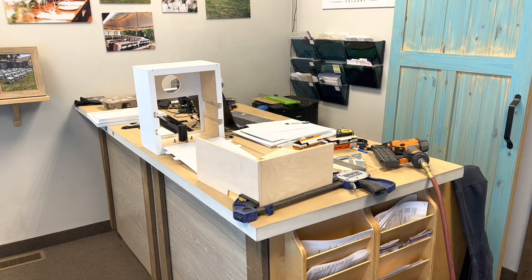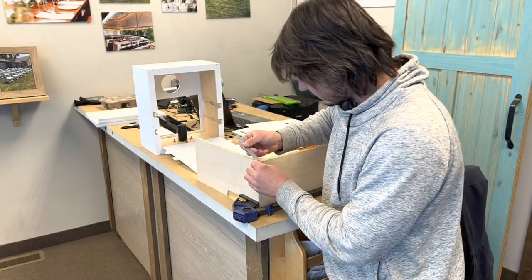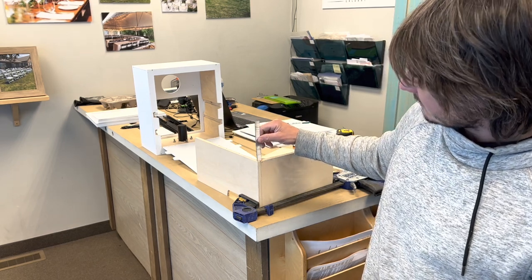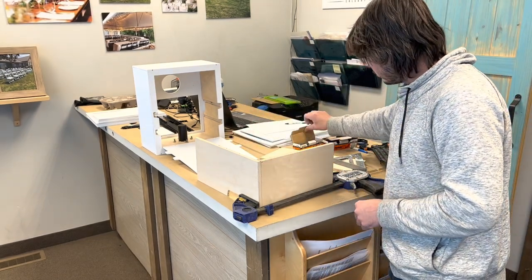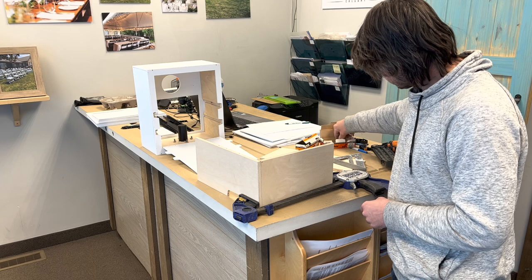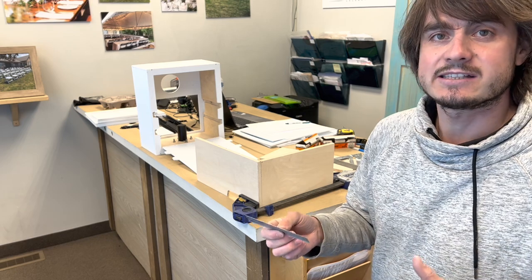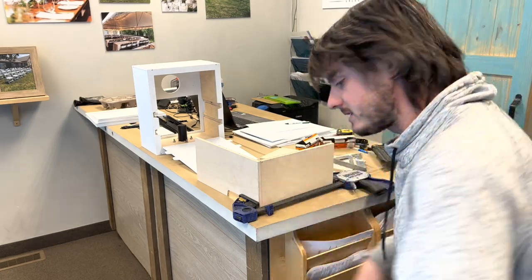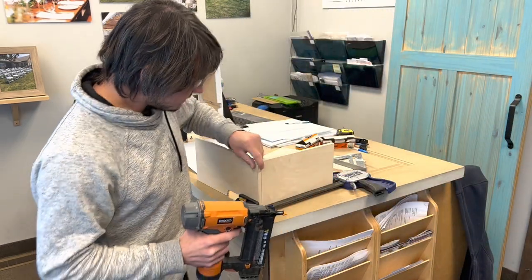I'm either using five-eighths — let's see — so that doesn't really go in at all. This is a half, this is five-eighths, so it doesn't really work. This might be handy for the puck board, but it's too small for the plywood. Here I have one and three-sixteenths, which is between one-eighth and one-quarter, and that's gonna do just fine. Remember to wear safety glasses — let me get some safety gear. I turned on the light, and now we're gonna brad nail it.